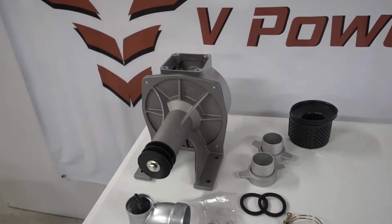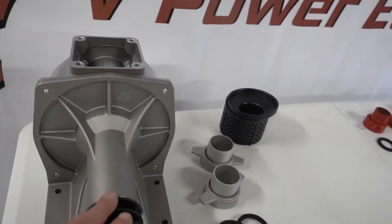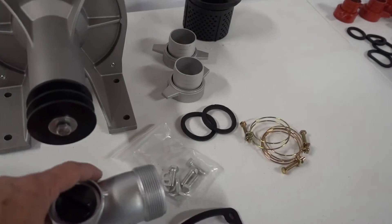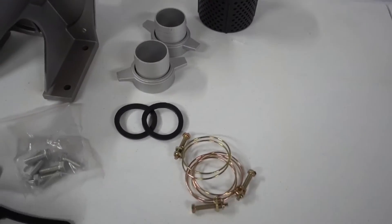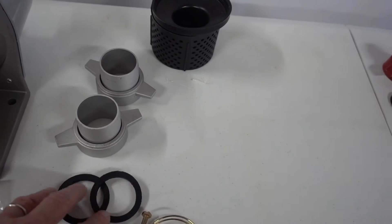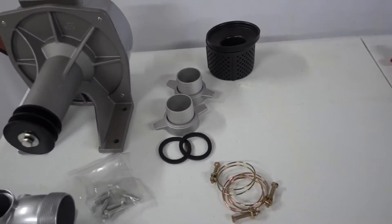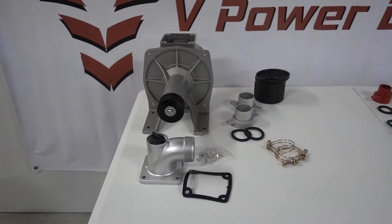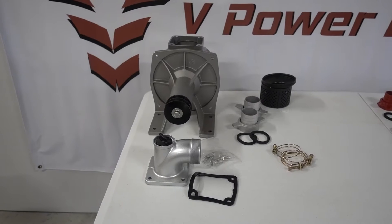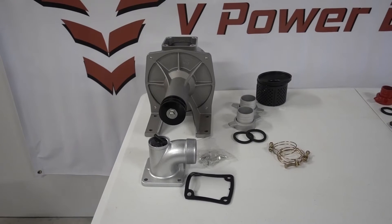Let me move the camera so I can show you the components of these pumps. First of all, this is the pulley pump, and this is basically how it comes. It comes with the complete pump, the housing which needs to be bolted on, the bolts and gasket, a few clamps, the inlet and outlet hose adapters with rubber washers, and the strainer. On this particular pump it is a belt driven pump — you just need to provide the engine, or you can use an electric motor. It needs to spin at around 3,600 RPMs.